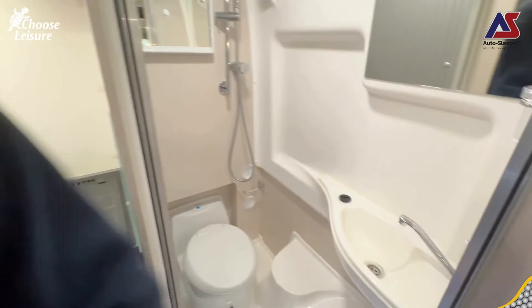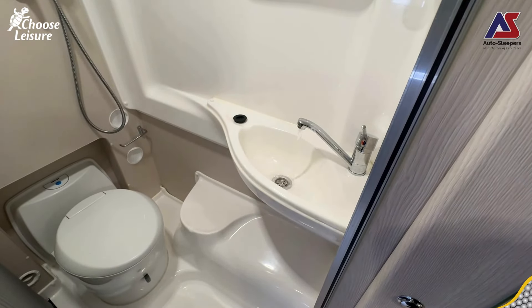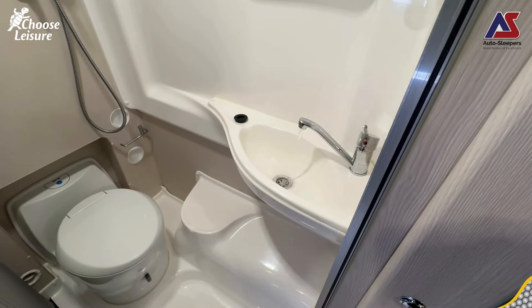I'm now going to turn the tap on - we've got some cold water coming through the tap in the kitchen. I'm going to turn that off and then come into the bathroom and turn the cold tap on in the bathroom - we've got some cold water coming through, just a little bit of air. Now what we want to do is pump some cold water through the boiler to effectively prime it. That is just as simple as coming onto the hot tap - it will cough and splutter for quite a while. Once it stops gurgling away - like a demented frog - then you've filled your boiler up and it's good to go. We need a nice steady stream of cold water coming through both the cold and hot tap.